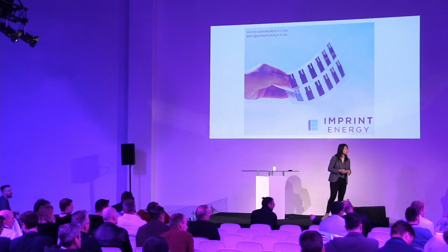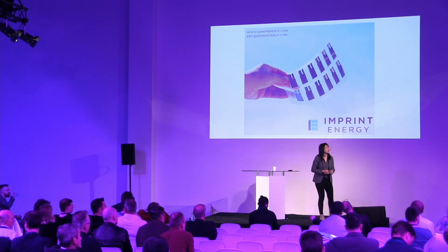Okay, and what's the degradation cycle count? I mean, when it starts to degrade, how many times can you recharge it? Yeah. So it depends on the methodology of recharge, like the rate of charge and what voltage windows. So for deep discharges, we're around 300 cycles or so. But for shallow discharges, which are more common for energy harvesting, we've done many thousands. And so the cumulative capacity, for example, for this battery can be on the order of hundreds to even thousands of milliamp hours with that type of charging. That's amazing. Thank you. Cool.